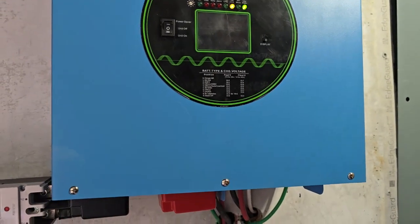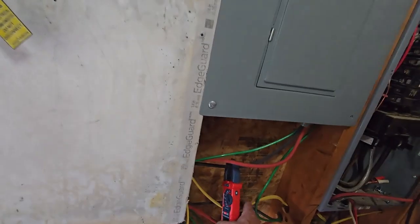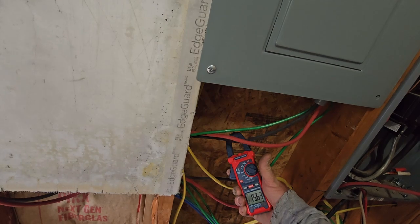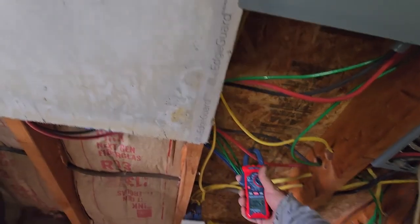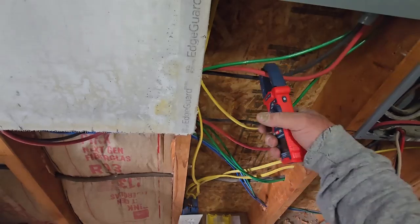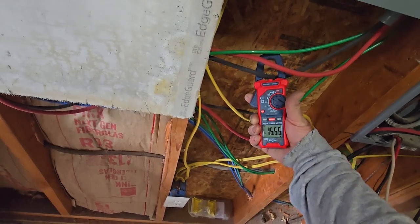Liking it so far. Our batteries are charged — they're all charged. Right outside, the roofers' compressor is running right now. On the system we have 16 amps, 17, 15, 16 amps on the black leg. That one has 1 amp. Out of our commercial power, 0.4 amp — which must just be the trickle charge for the batteries. I don't have my solar panels hooked up yet because the roof is obviously going up. Hey, it's working. I'd like to see if when the compressor stops, if that's actually what changes.